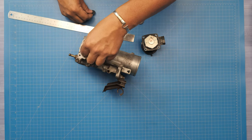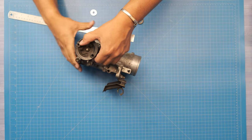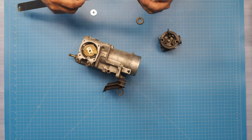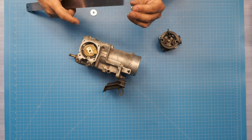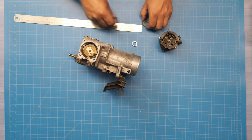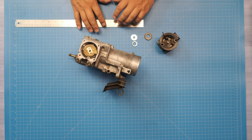Trying a couple other washers - this one actually fits nice and flush even with the little wave in it. It's about three to five millimeters, but there are some recesses it may be sitting down inside. So we'll start with four millimeters and after our first test print we'll know more. Let's go into Fusion 360 and start working on that.